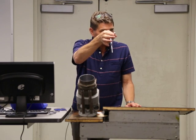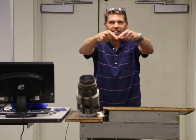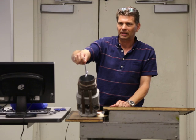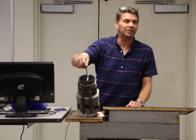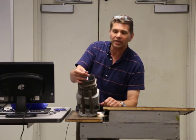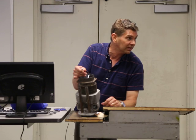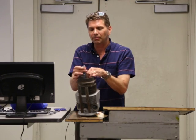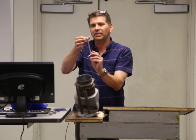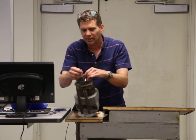This is a very three-dimensional problem. Number one, I've got to get the T-gauge perfectly perpendicular. I have to get it in the largest part of the cylinder — if it's crooked at all, it's going to measure too big. It has to be perfectly parallel and perpendicular both. I usually start it off to the side, let it go in the middle crooked. I measure right at the flange — the book says about one inch down, and that's about one inch down. I hold one end where I want it, bring up the other end until it's in line, and it tends to center itself.